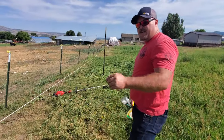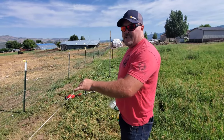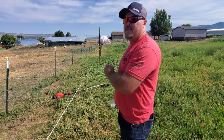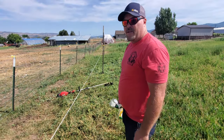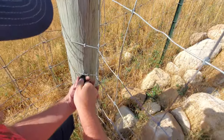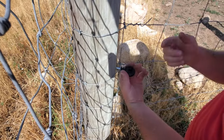Another thing to remember: any way that this wire is going to go to ground — if it's touching the dirt or touching a metal fence post — it's going to short out and it's not going to work. You want to keep it totally isolated from any source of ground whatsoever. On your side where you've got your controls, make sure you've got a good ground rod. I have two ground rods pounded in — one right next to it and one a few feet further away — to give it good ground, especially if your soil is real dry. That's how the current returns back to the source through the ground, completing the circuit. There are different kinds of insulators you can get — this one's what they call a house knob insulator and they just screw right into the pole. There are also different types that clamp down onto a T-post.